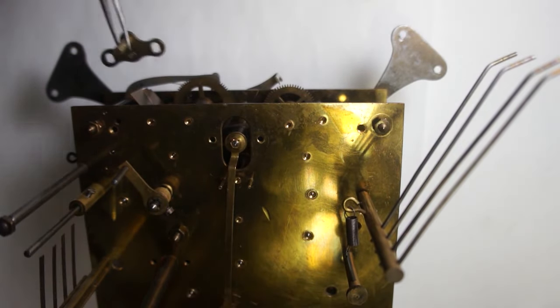I can take this drill plate and pass it right through there, and also under there. That drill plate actually measures 69 thousandths. So that's quite a warp on that piece, but I'll go ahead and work on this and get it so it's not so warped best I can. It's not going to be perfect. And then we'll remove that silver plate on there and re-silver it, and then just move forward from there.